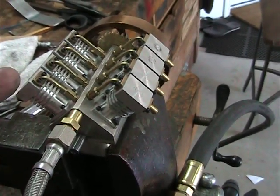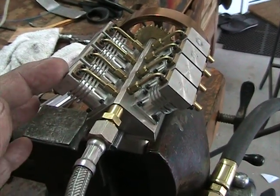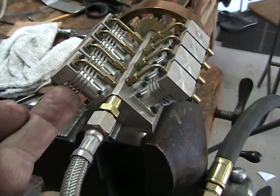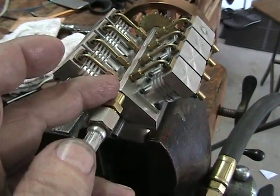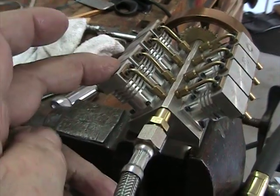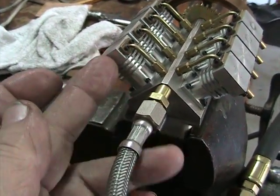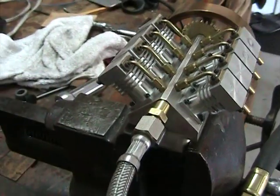And then there's a ball valve and a spring in here. When it fires, the ball valve is forced to the side which opens the port to let the high pressure air into the piston. And when the valve over here closes, the spring returns that ball over to this side and lets the air exit out through the exhaust.